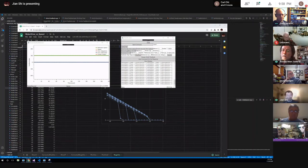Yeah. I had considered actually having four encoders and four PID controllers, as you said. But in my playing around with it, I realized that when the robot was on the wooden deck and it did a turn, even with a relatively weight-balanced robot, it was unpredictable which of the front or rear wheels were actually doing most of the skidding, because it has to skid around a corner. So even with four encoders, I wouldn't know which encoder to trust. I just figured I would go best case and assume the front and back wheels were skidding roughly the same.